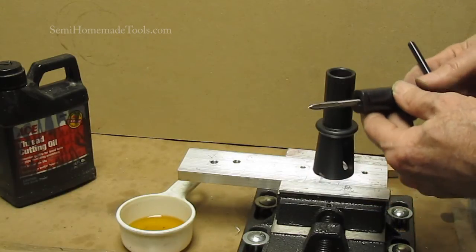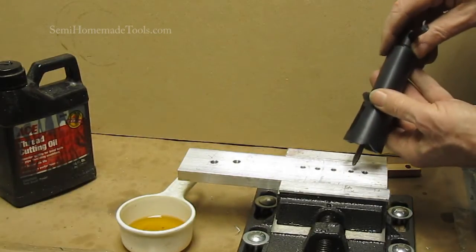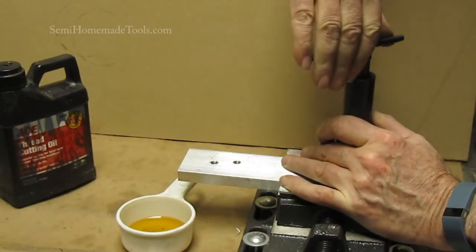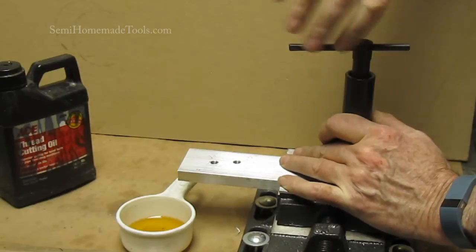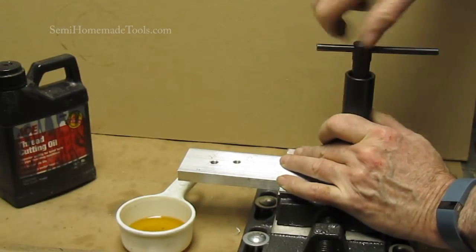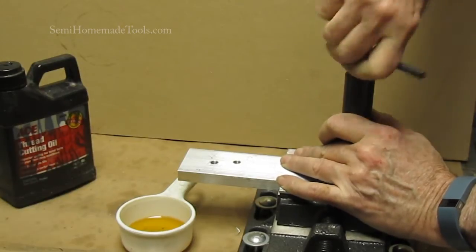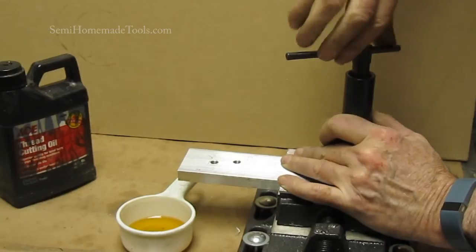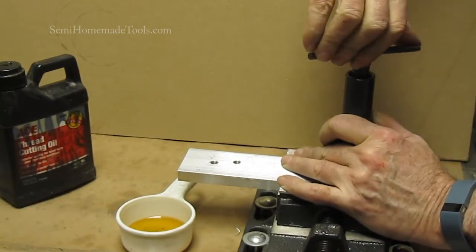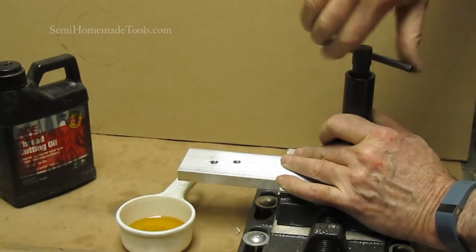If you don't spend enough, the axis of the tap is not perfectly aligned with the axis of the barrel, and you're going to end up a little bit crooked. I think this one is pretty good — it's only about $20, but I wish I had spent a little bit more. Just like before, we're going to make sure we get the thread cutting oil on there, load this up, set it right in the hole, and get it started. Once we're started, we're going to have to start backing off a half turn to break the chips loose.